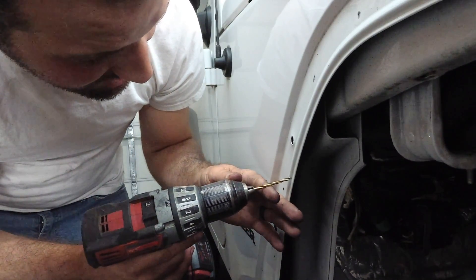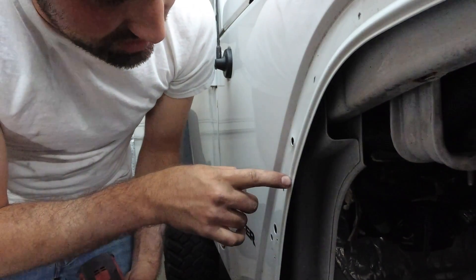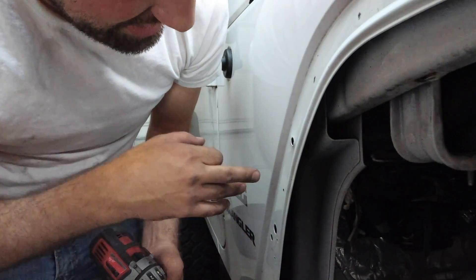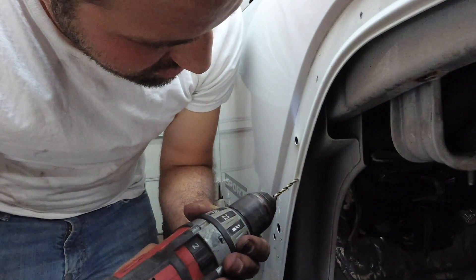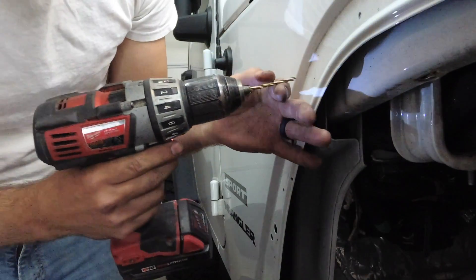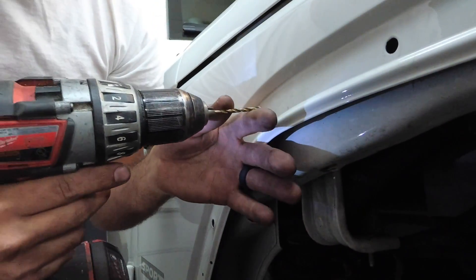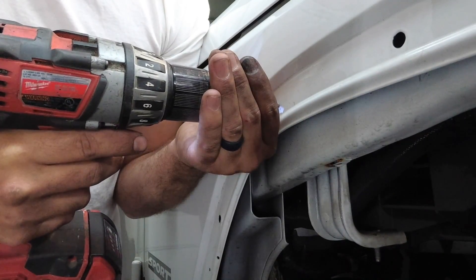There's one right here on the edge, so you're going to want to cut back at an angle. The drill bit we have to go on behind here is actually larger, and if it's on this fold it's going to be kind of hard. So I'm just going to go up at an angle, and when I come back with the other drill bit I'll try to shoot it back this way. I'm really trying to let the drill do all the work — once I get it going I don't want to hold my hand here and catch all the hot metal right in my hand.